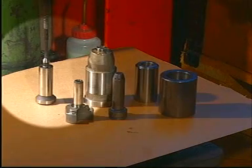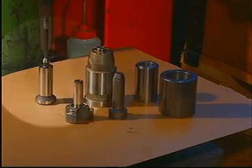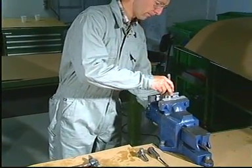The thrust piece, spindle and spindle guide are matched parts and therefore must not be replaced individually. To keep the matched parts together, disassemble only one spindle guide at a time. Dismount the fuel nozzle using the pulling tool.